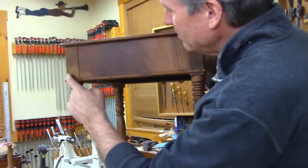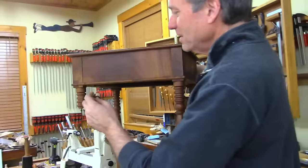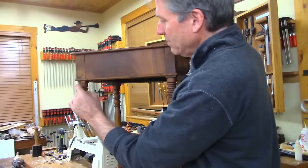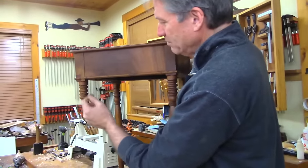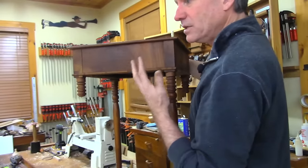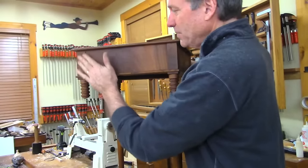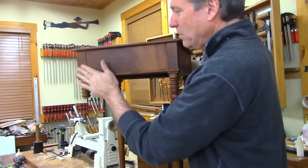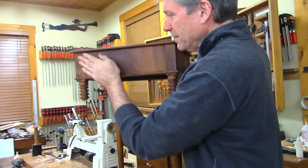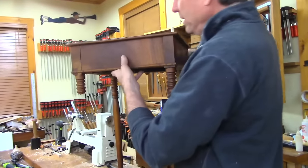I guess they were thinking maybe it was going to lighten over time. So I might have to pull that off and get this veneer back on, and it might be worth replacing that beautiful patch. Now, more than likely, this veneer is on there with hide glue. So I could just take a steam iron, dampen this a little bit, and with a dampened paper towel, put it on there with the steam iron, and this will just release. And you can repair that pretty easily.